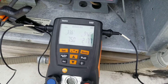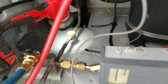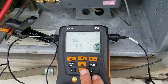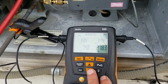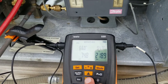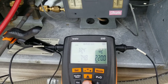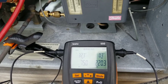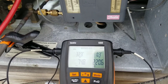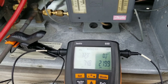I've added about eight ounces of R404A into the system. My sight glass is clear. My evaporator temperature is up to 33, but keep in mind my box temperature is still hovering around 55 or 60, so that's going to be a little high for now. My condensing temperature is right about 30 degrees above my ambient. Superheat's still a little high, but you're not supposed to look at that too much until you get within 5 to 10 degrees of your set point temperature.